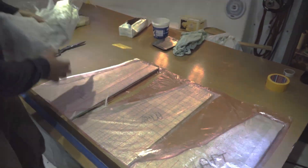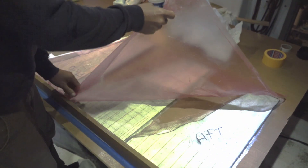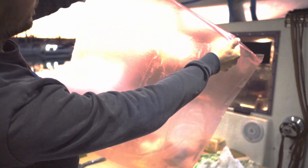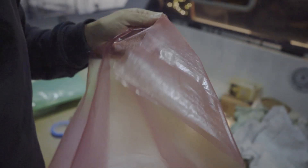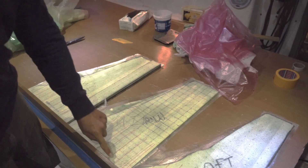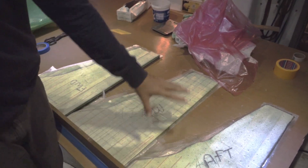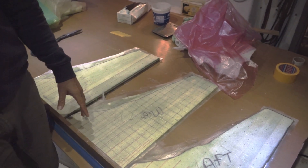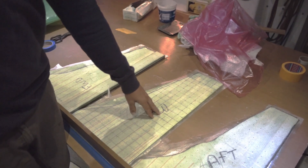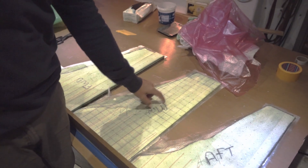Let's get rid of that layer. Then we have our perforated plastic. This plastic - there's a piece of nylon plastic with lots of little perforated holes in it. Normally you don't recycle this. Can't recycle that unfortunately - all the little holes are filled up with resin. All plastic in the bin. That's our perforated plastic. Now you can see where the red stripes are - that's my peel ply. I didn't peel ply this entire part. I'm a huge fan of peel-plied surfaces everywhere, but I didn't peel ply this entire part because, to be honest, I don't really need it - I'll be giving this a very light scuff, potentially even just a scotch bright, and painting directly onto that.